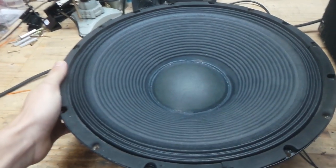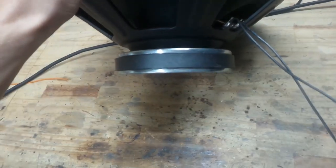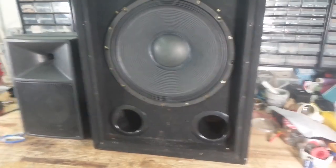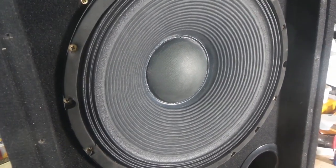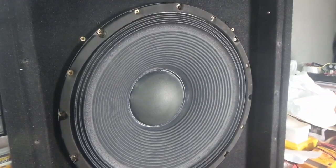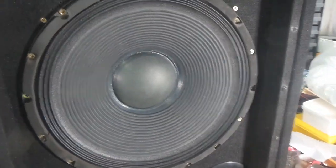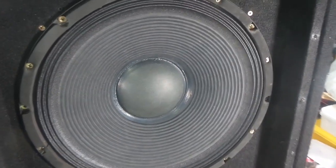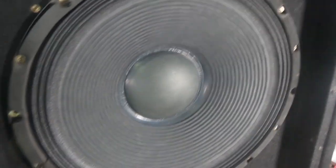So it's been about 12 hours. And look at that — it looks great. It definitely sounds a lot better than it used to. It's not making that horrible buzzing sound anymore. Just going to put it back in the box and see what it sounds like. I'm not going to turn it up all the way because then it'll just sound bad on the microphone. But as you can hear, no buzzing sound. So I'm quite happy with that. My guess is that something got stuck between the voice coil and the magnet, just causing the voice coil to rub against the magnet and making that horrible buzzing sound. But now that we've tried to remove whatever was in there with compressed air or even a little piece of paper, we somehow managed to get whatever was stuck in there out of the gap. Sounds fine now.